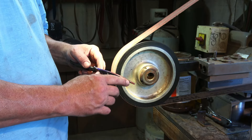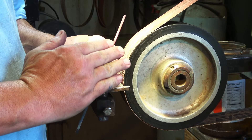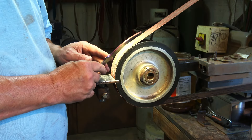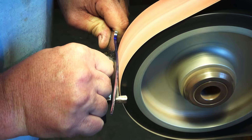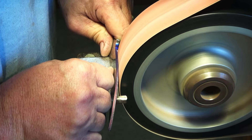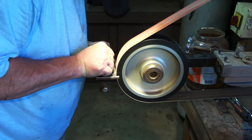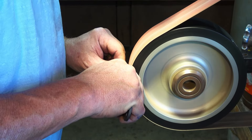I've got my center marks here. I'm going to go ahead and do a 45-degree bevel up to those center marks, and I'm going to do that with a dull 50-grit belt. Then I'll replace the belt with a new one and grind in the bevels — this way I don't shear off good grit on a new belt on that hard edge, and I've established my plunge lines. Even though I'm just putting in these initial bevels, I'm using the same techniques I'll always use: slow steady movements with my arms by my side, braced.